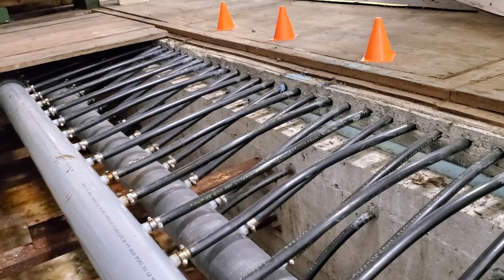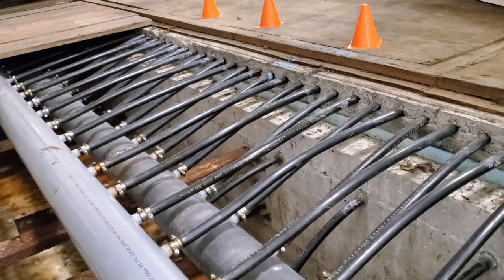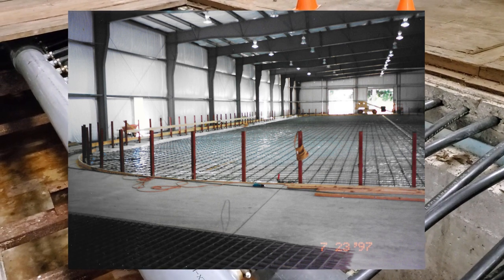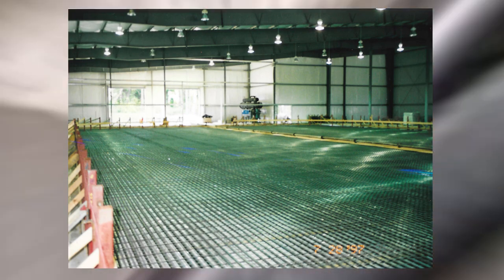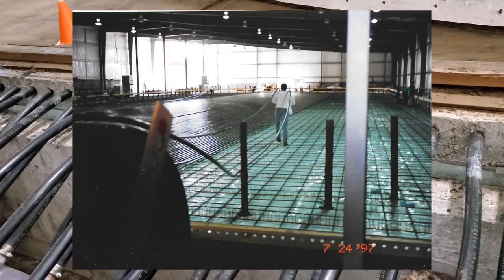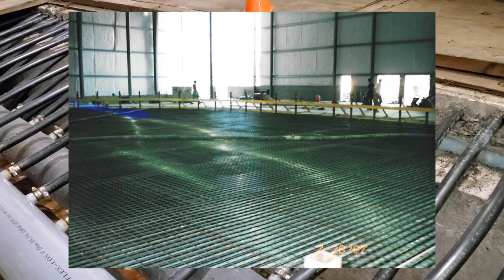So basically, metal tubing is not really done in ice rinks — it's rare. What's common now is HDPE piping with fusion-welded header pipes. You don't really use PVC or these kind of mechanical connections anymore. I'm going to leave it there for now and do a subsequent video on rink floors, because I really didn't touch on a lot of things. I really want to do a video on the three different types of floors — the pros and cons of sand, concrete, and mat-style floors.